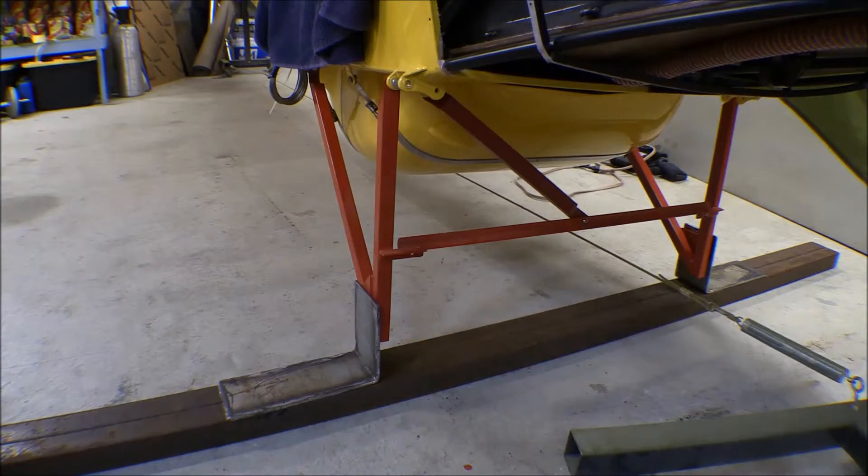I cut this set of box tubing at five feet, but after getting up here and looking at it I could see that wasn't going to be enough for lateral stability once you start putting the wings on. Especially once you get one wing on, it's going to be pretty heavy on that one side and want to tip up. So I decided to go a little wider — fortunately that piece I cut from was originally 12 feet long, so I was left with a seven-foot chunk of that doubled box tubing.